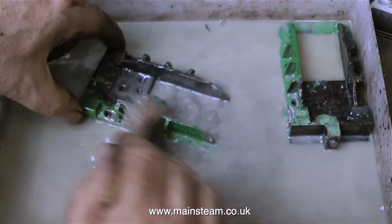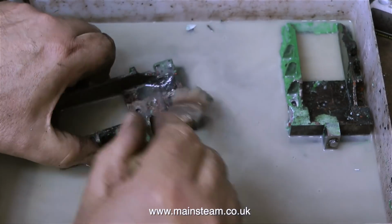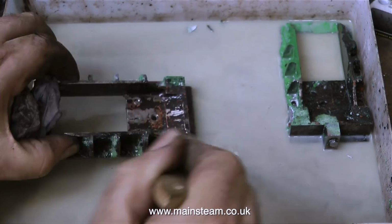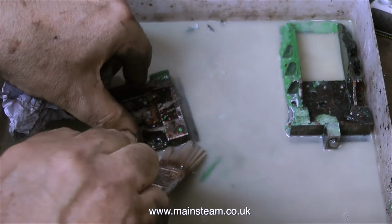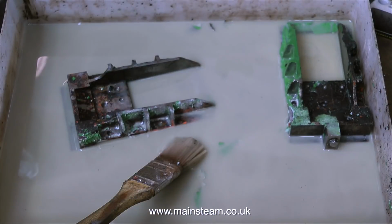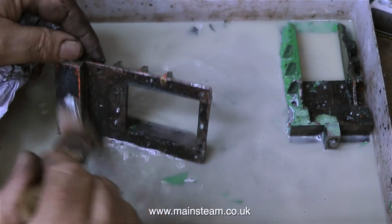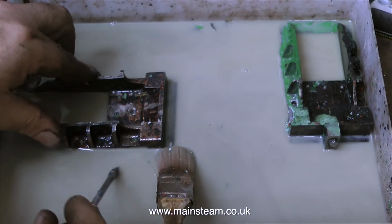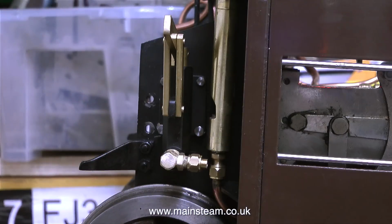The bearings have been worn oval by the weight of the traction engine on the axle over a period of time. We had a bit of a meeting and looked at the components. I suggested a way of fixing it using an expanding reamer to increase the diameter of the gunmetal bearings and then put a sleeve on the axle. But that idea was dismissed by the powers that be, so I dismantled the engine without complaining, and after I've cleaned up the parts, I'm going to give them to Graham, who's the machinist at the Steam Workshop, to make new bearings and machine down the axle to fit.